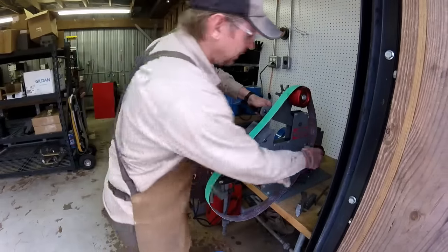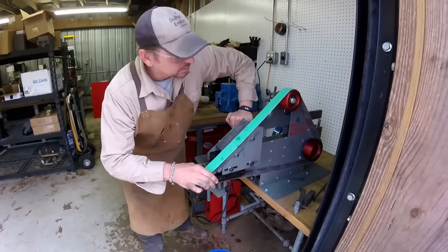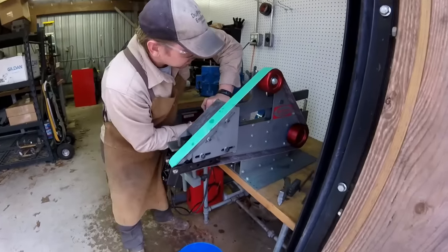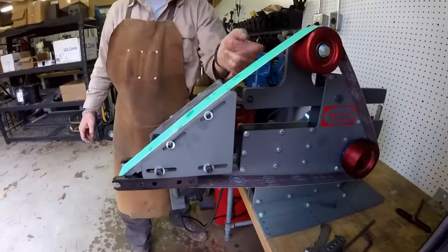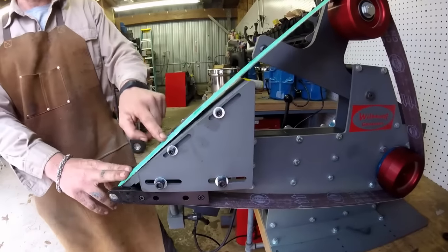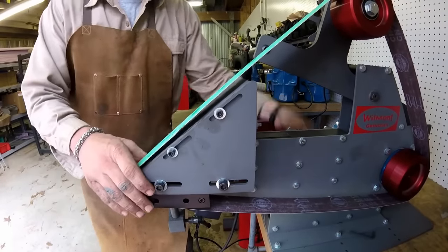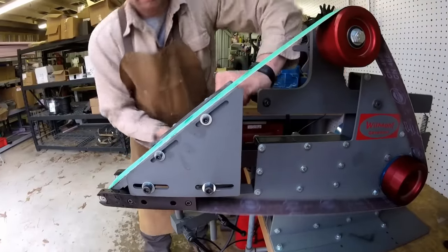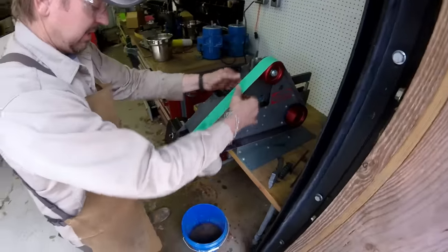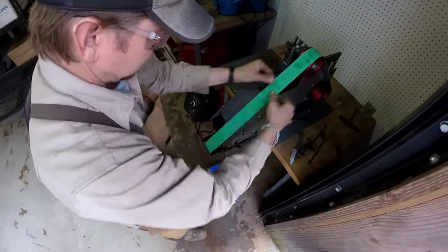What we do is tension the belt so that the belt is touching the back of the jig. It's touching the back of the jig — you guys see that? That's important. If it's in too far, that's not good. We don't want that. We want this belt to be riding the back of the sled. I'm going to go ahead and pull this push. There we go, nice. Now we're going to rotate this by hand to make sure this belt isn't going to want to move too far to the right or left. It seems to be okay.